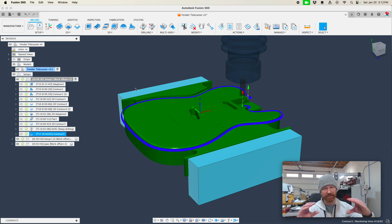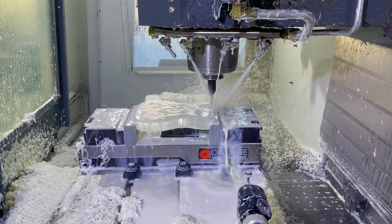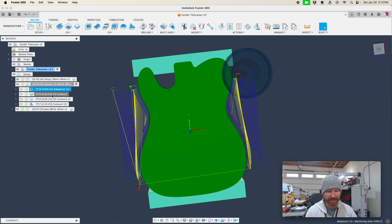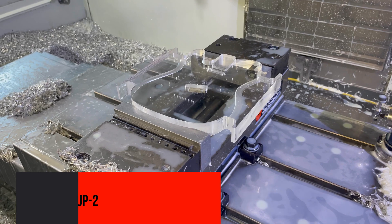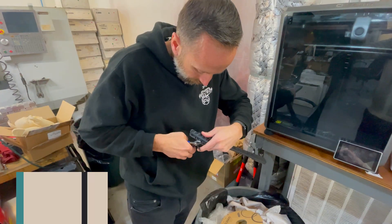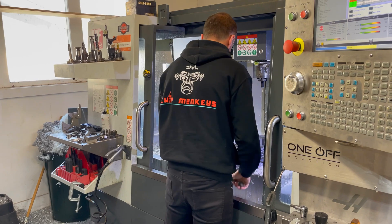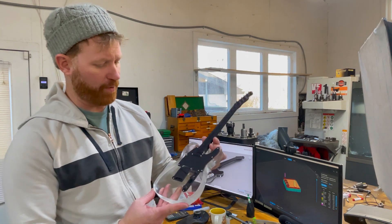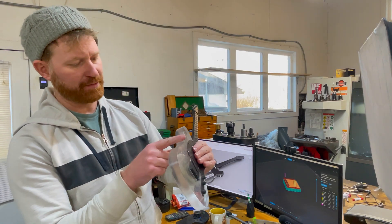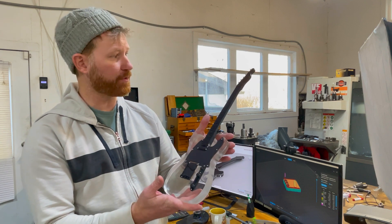He's nowhere close — about 20 thousandths off right now. What you hear in the background is op two. We just cut some soft jaws, grabbed him up, and now we're doing the roughing right here, then we're going to blend in these cuts on the side. Might hit it with a bit of Windex, but not too bad — all the tool paths seem to line up really good. Screws worked really good. I think we're good, we got it.